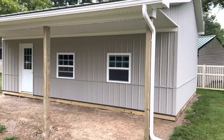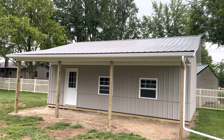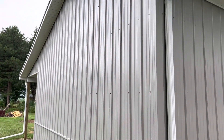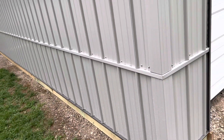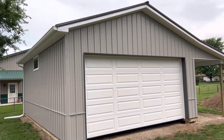Again, a 20 by 28, 10 feet tall, with a monochrome wainscote. You can see how he came off that porch — that's a traditional 4/12 pitch. Let me get you the backside of this and also the 4 by 2 window on the other eave. This is a nice, quaint, functional two-car garage. You've got the gutter installed as well. Look at that wainscote matching the sidewall steel with some accentuating trim. Comments are always welcome — until the next one, keep it locked, keep it loaded right here at Attica Lumber and AtticaLumber.com.